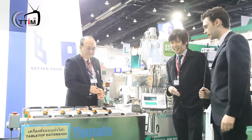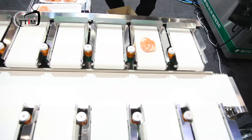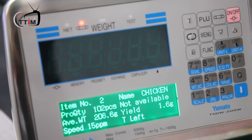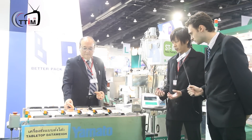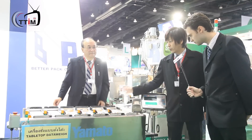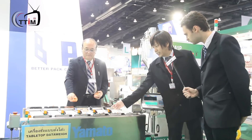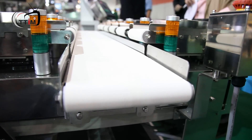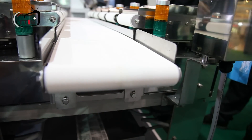Maybe let's go have a look at it. So what have we got here then? You can see that it's very similar to multi-head weighing but the difference is it's not in a round shape. What we need to do is just put each product on each head. It doesn't matter that the size of the product is the same or not — it can be various. What the machine will do is combine each head of product to the target weight and then feed it into the center belt, so the product will run automatically. What you need to do is just receive it and bring it to the next station, because this helps product companies reduce giveaway.